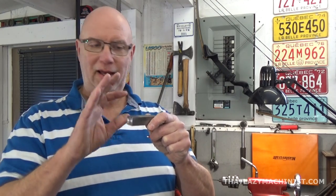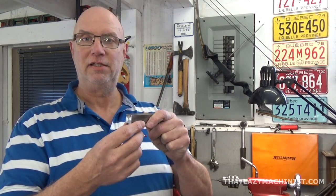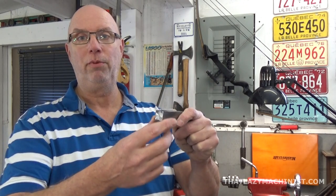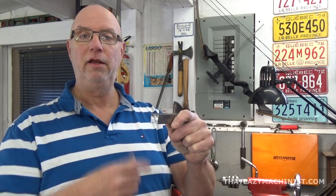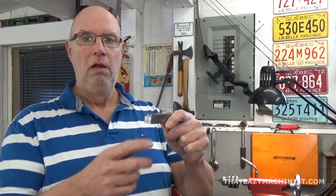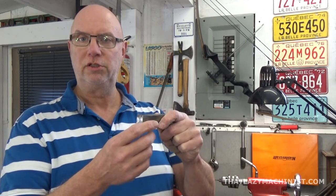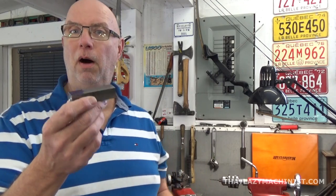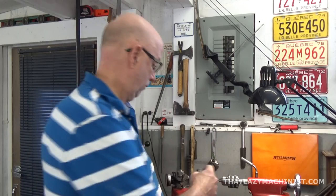And that offset will not be touched again. Then I'll offset sideways 1.73 millimeters for the first lobe, and then back to 0 and 1.73 millimeters on the other side for that second eccentric lobe. But my height won't change, I'll just offset it once, but it will slide back and forth here. And well, that could mar or mark my part.